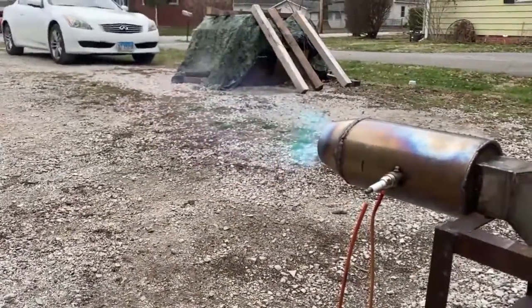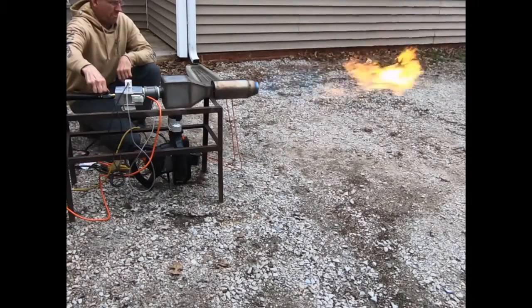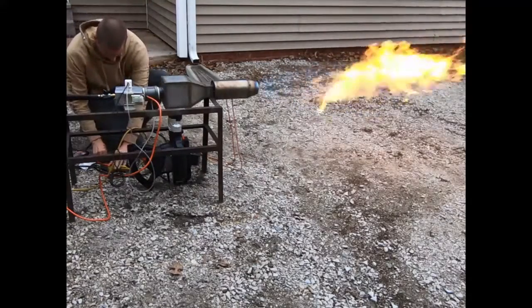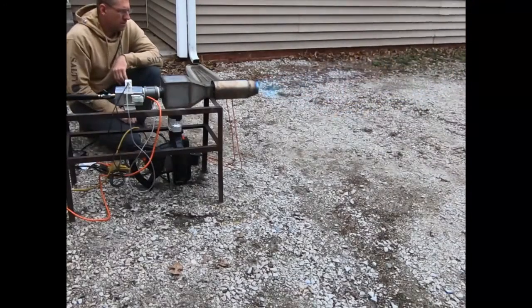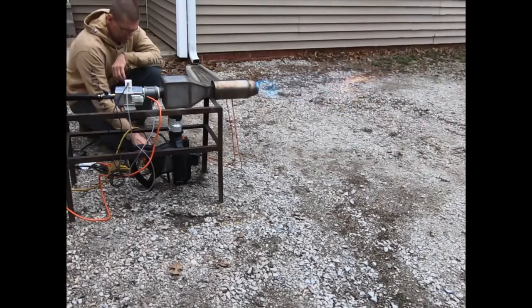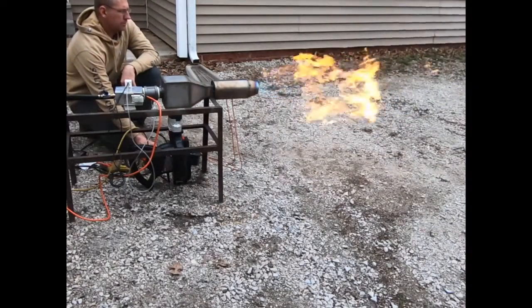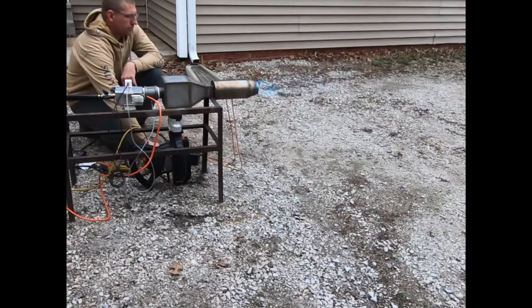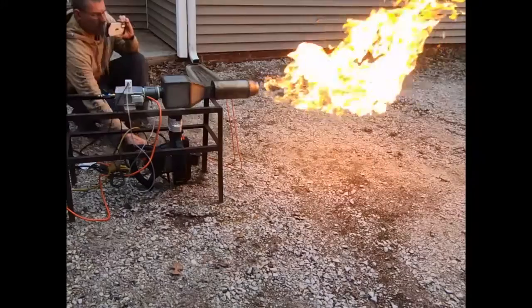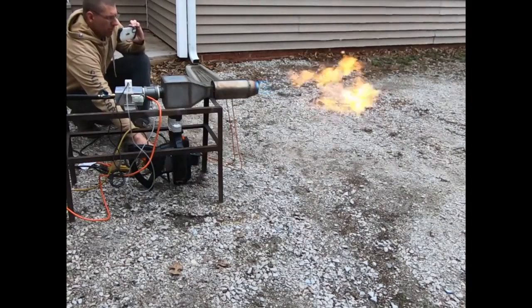It takes too long and it has to be extremely accurate on the internal portions of the venturi, or else you get asymmetrical combustion patterns which can burn out the combustor and all kinds of weird stuff. So it was worth testing it though — I had to know for myself. I don't know if I like the spark plug positioned the way it is here. It is prone to a much hotter ignition. It's a little bit louder and a customer isn't going to want these big fireballs and explosions. So it's out.